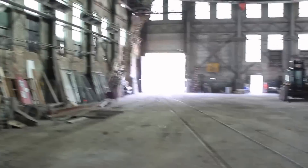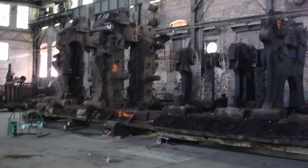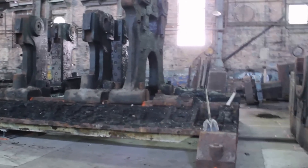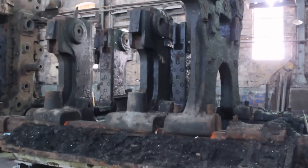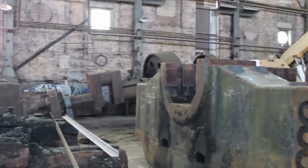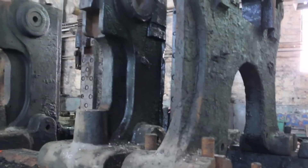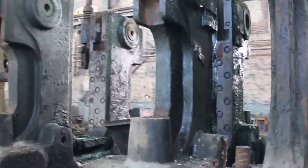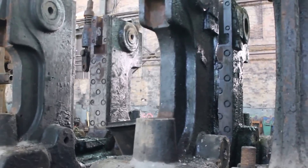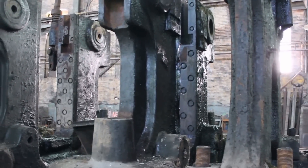Over here at the rolling mill itself, we start out at the pinion stand. The power from the engine comes off the crankshaft — one shaft comes over into the pinion stand through a set of gears, and basically you'd have two output shafts coming off.